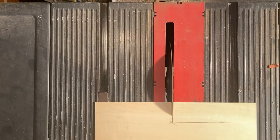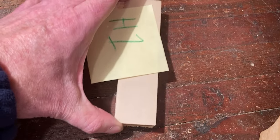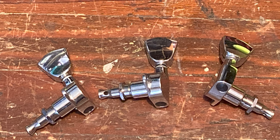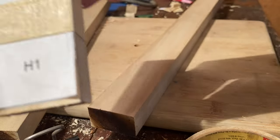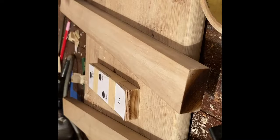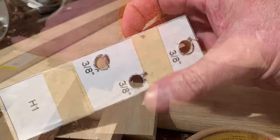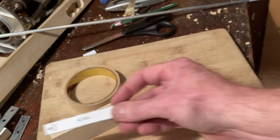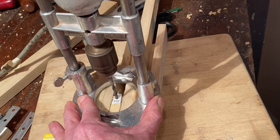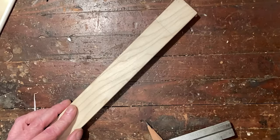This is to add thickness so your tuning machines will fit properly once the project is complete. Once the glue is dried, cut out pattern H1, tape it to part H1, and drill according to the pattern. Now do the same with pattern H2 and part H2.